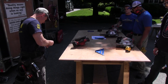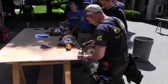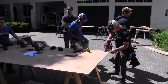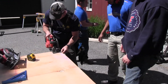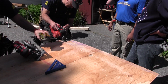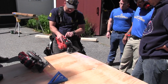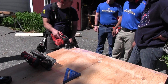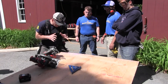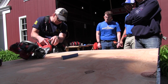Now let's talk about using the saw. This morning I talked to you guys about stance and balance. I'm going to line up on my zero — where's my finger right now? Off the trigger, right? I'm going to hold the saw with two hands, push the safety down and turn it on. What are my legs doing? I'm in that wrestling stance — balanced, strong. I'm looking at my blade, pretty straight, and I can make adjustments as I go.